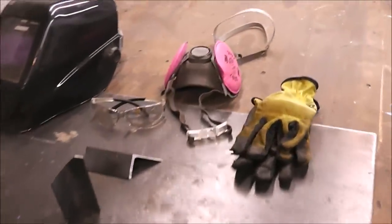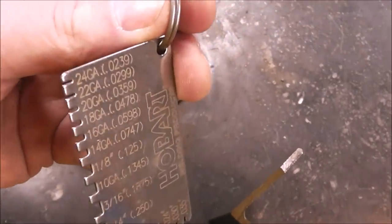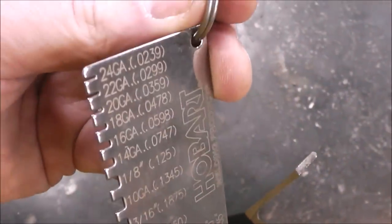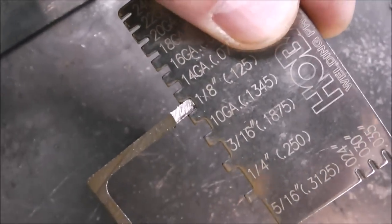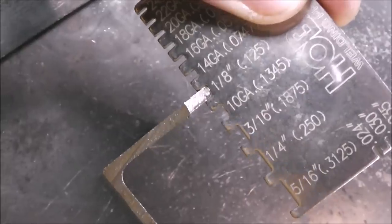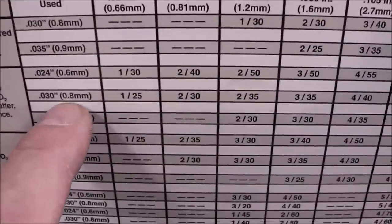With all our safety gear — helmet, glasses, respirator, and gloves — and a couple of test pieces, we've got to set up the welder. This is a gauge to tell you the material thickness you're working with, so you'll know what to set the machine up at. This right here is eighth-inch angle. That confirms we're welding on eighth-inch material, or 125 thousandths. So we'll open the welder — going to steel, C25 gas, 30 thousandths wire.